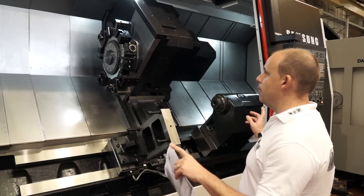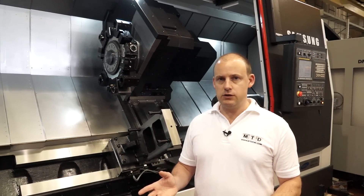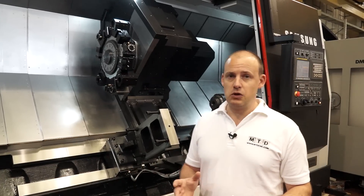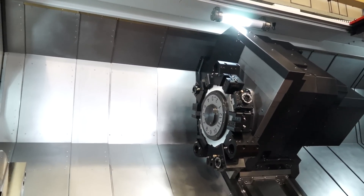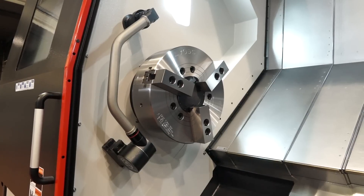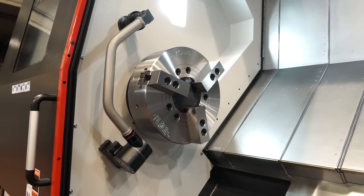We've got two doors and plenty of light and very good access. So who's going to look at this type of machine? Well, it's not for every subcontract machinist — it's a big machine but it's got a lot of capability. If you're oil and gas, if you're working with exotic materials, large 15-inch or 20-inch billet work, you can see that this chuck itself is capable of holding that type and size of component.